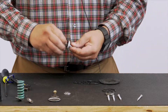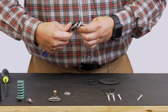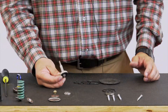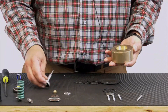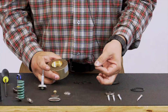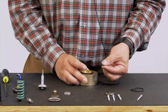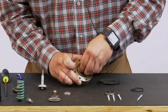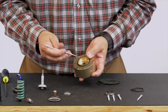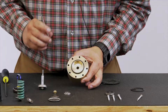We have a couple of small O-rings — we'll get those installed. A little food-grade grease will help you installing these. We've got the lower and the upper O-rings installed. Let's get our new disc and put that on with this nut. Tighten this down — use that old diaphragm to hold it and make sure you get it tight. There's our lower disc assembly on the stem. Now we'll get our sensing chamber. It had a couple of O-rings — one in the middle and one just below. Here's our large body O-ring — use some food-grade grease to keep that on. We have this larger, thicker O-ring that's going in the middle, so we're going to squeeze that in and use a pick to guide it into the groove.